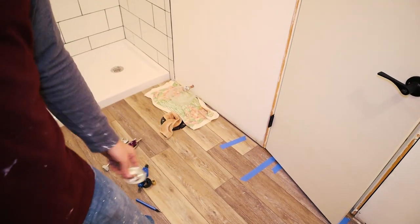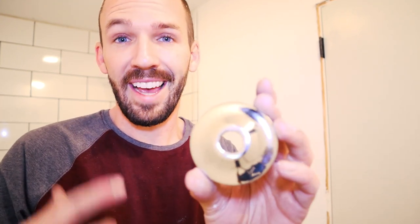I forgot to put it on the floor first — I'm going to put this little flange on the pipe right there. Now I'll use a compression ring, but those are really hard to take off and I don't want to cut the copper pipe because it's already pretty short. So I'm going to have to get the after-installation ones where you can hinge them around.